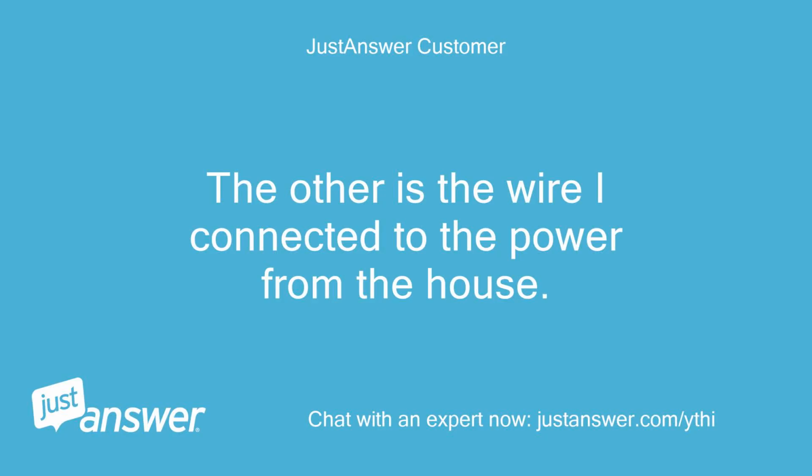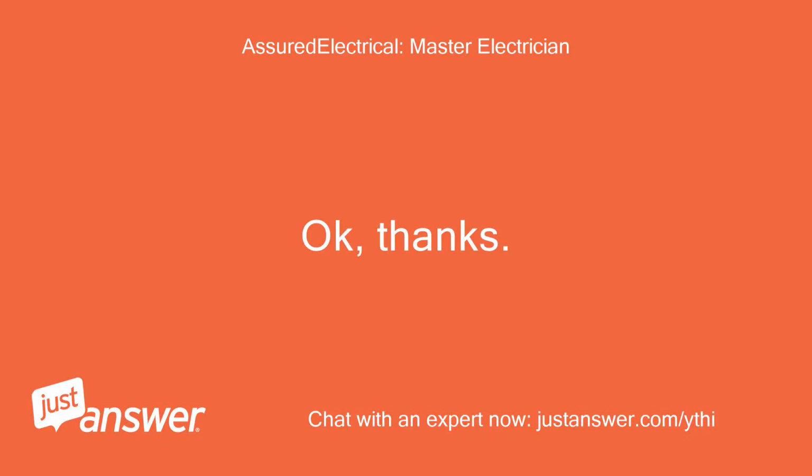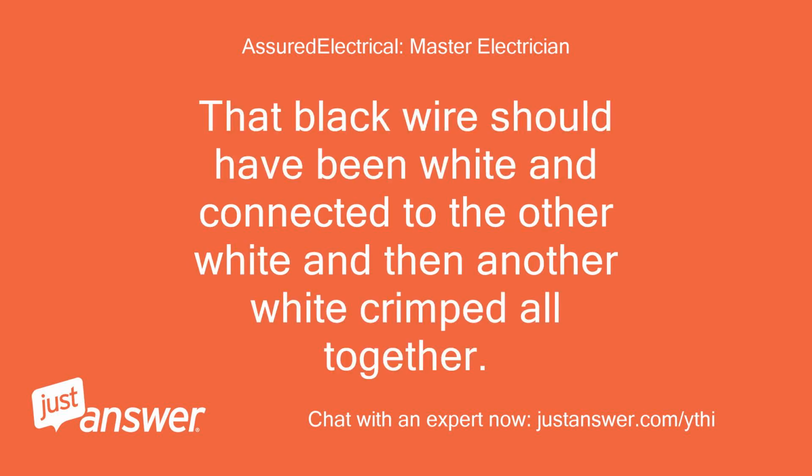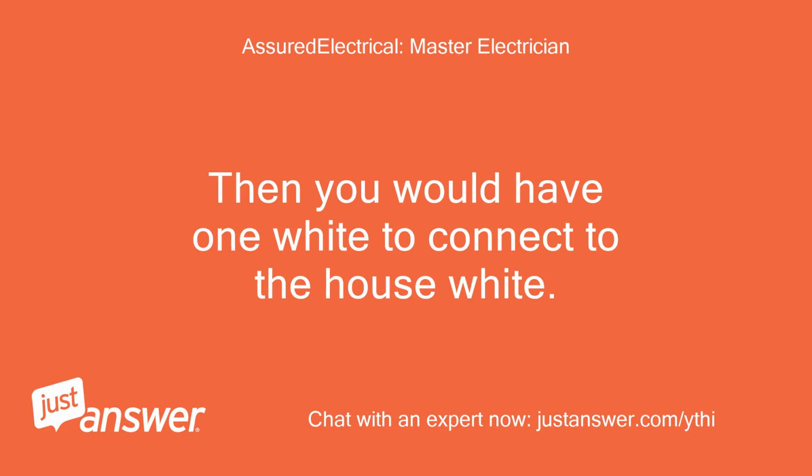The other is the wire I connected to the power from the house. Okay, thanks. I believe you have a factory miswiring here. That black wire should have been white and connected to the other white and then another white crimped all together. Then you would have 1 white to connect to the house white.